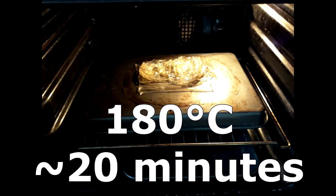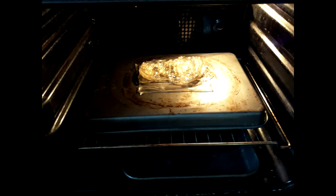Then put on the stack of plastic, and then the washers around that. The washers are used to set the thickness. Once it's all in the oven, set to 180°C. It will take about 20 minutes for the plastic to melt. You will know by the hot and gooey look that it's ready.